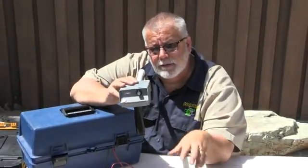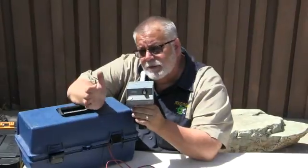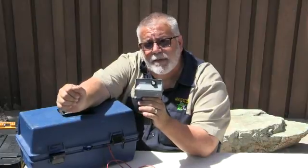You're always listening with the headset, hooked up to the unit, in the field, watching the gauge. As you're bouncing back and forth, when I'm on top of the wire I'm listening and I'm seeing — it bounces back and forth when I'm right on the wire. If I go away from the wire, it goes 'da-da-da-da-da-da' and gets silent over the wire. When I'm over the top of the wire, it's silent. When I'm away from the wire, it makes that noise.